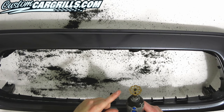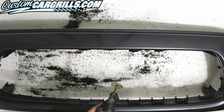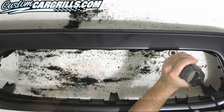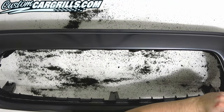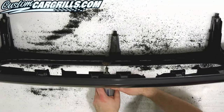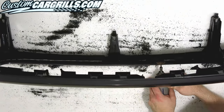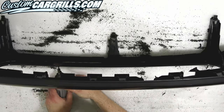Now I'm going to use a dremel with a cutoff wheel to cut along the guideline I'd drawn in the previous step. A larger cutoff wheel can be used, but I like the dremel version because it's a good size and it's not going to allow me to cut too deep. Getting the right position and angle is really important here. Making a good clean first cut will reduce the amount of work later that might be needed in order to straighten this out.